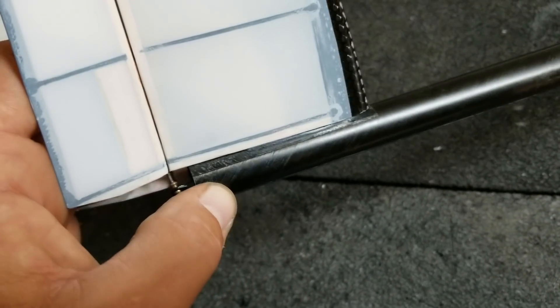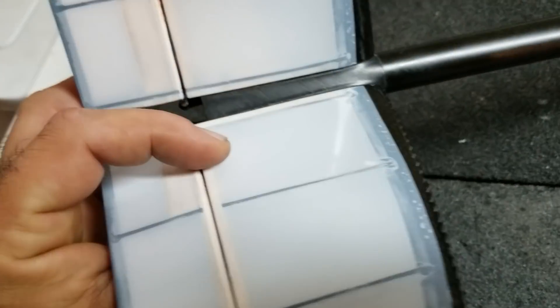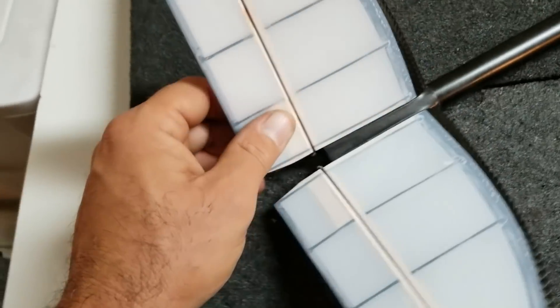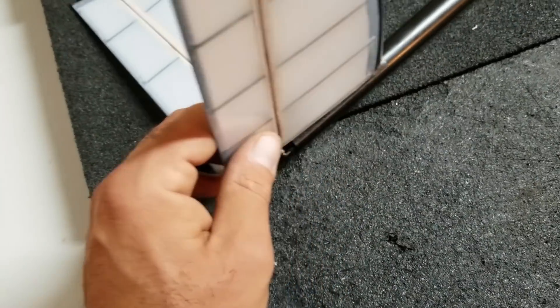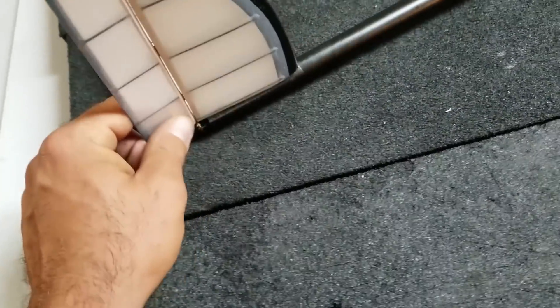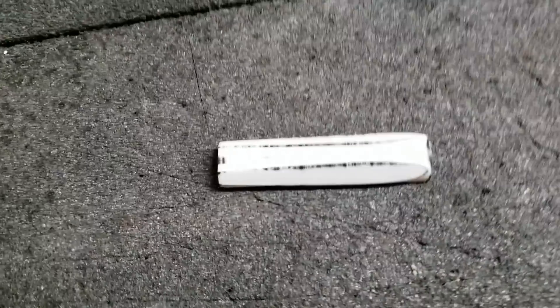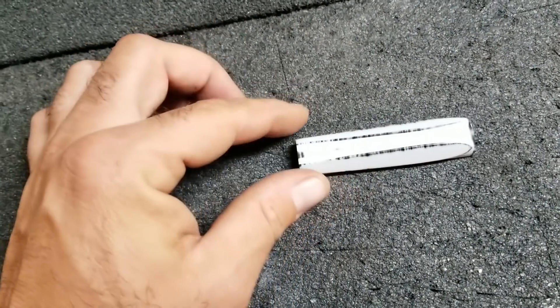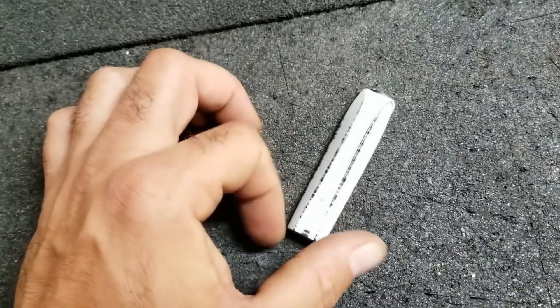The way I mounted the V-tails to the boom, I actually molded a little carbon fiber perch for the V-tails. That was a neat project — I designed the perch on the computer and 3D printed a part. This is my 3D printed part. I primed it, polished it, and took a mold off of it.